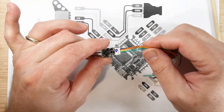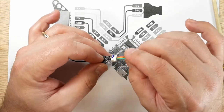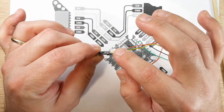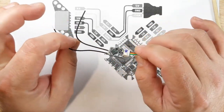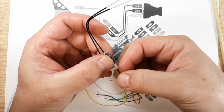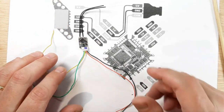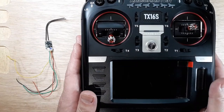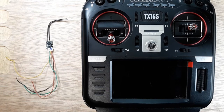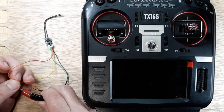For my use, I'm going to remove and unsolder this connector — cut the wires and solder them directly to the RXSR. I'm not going to show that in the video because it's easy to destroy the pads. For now, what I'm going to do is create a model and bind this up. We'll name our model and get that ready. I'll also use a bench 5V supply — I'll try to put a card up on how to make an inexpensive bench 5V supply.